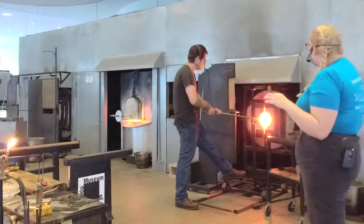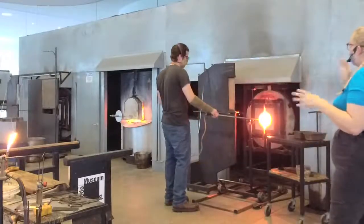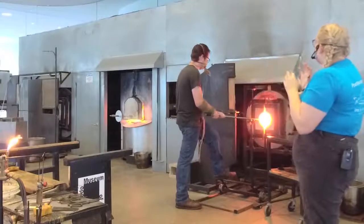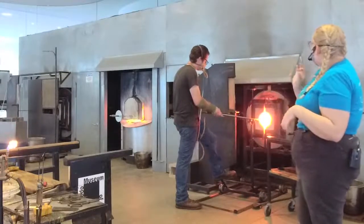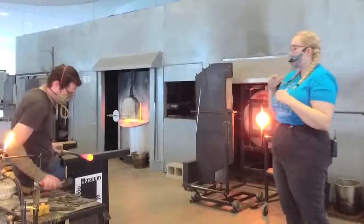Misha's going to melt that in and even it out. The glass naturally wants to return to the round shape it has when it's in the furnace. Misha's going to make this bubble nice and even. If this bubble's too small when we go back into that furnace, we can have problems later on. You can really see the difference in heat — the glass has that nice cherry-red glow at the edges where it's really, really soft, versus getting darker closer to the pipe end.